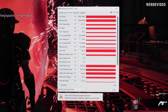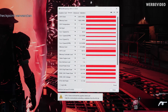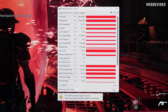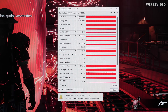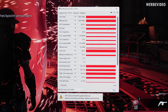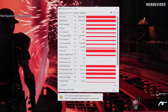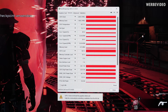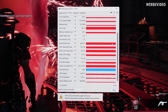After the usual 30-minute warm-up phase, we're looking at the stats of the card. Just below 2,900 MHz on the GPU — that's about 20 to 30 MHz more than what we saw on the ASUS Strix or the Gigabyte Aorus Master. But you won't be able to tell a difference from 20 to 30 MHz, and this could also be due to individual GPU quality or the silicon lottery. GPU temperature is about 3 to 4 degrees Celsius higher than the ASUS card, about the same as the Gigabyte, but at much lower RPM. Board power draw is again about 290 to 295 Watts.